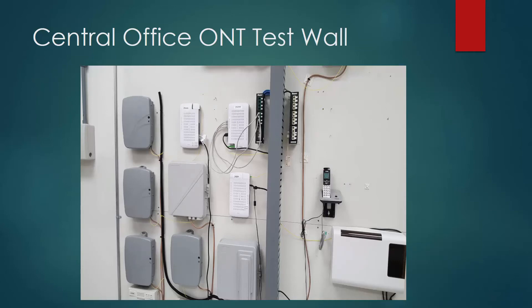This slide shows ONTs — different types of optical network terminals. These are set up in different ways. These are outside enclosures, so you can put them outside your house. I will have a video later showcasing the ONT and how it's set up and terminated. These are usually for residences. This unit here and here are for multi-unit dwellings, apartment buildings, possibly trailer court homes. You'll see inside that there's multiple fiber lengths inside those. And these are some ONTs that you would find inside a residence.